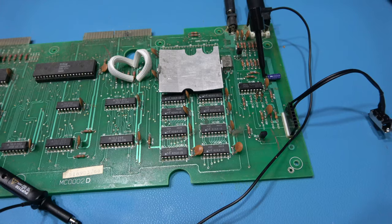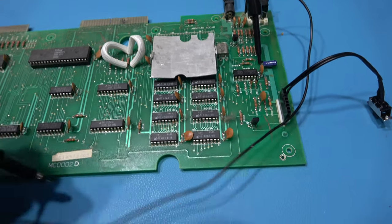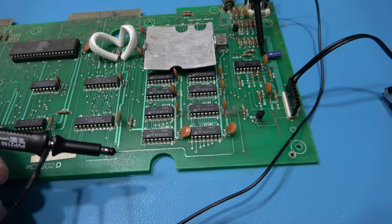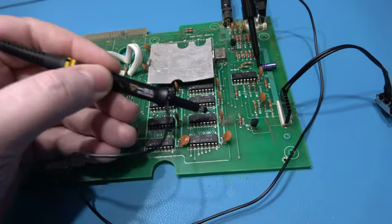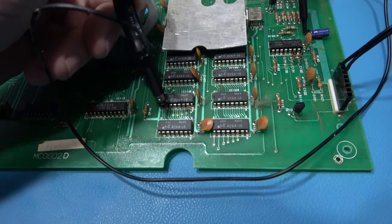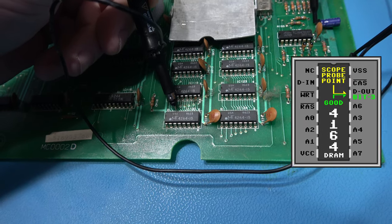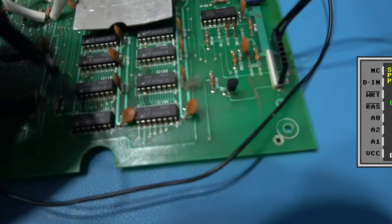Houston, we have a problem. I'll show you what I found. I started checking the RAM in this order. Instead of going up and down or down and up, I went like this. And I'll show you what happened. If we check this output of this RAM, which is pin 14, which is just there, we can see that thing is happily doing its thing, right? And I'll move on to the next one,